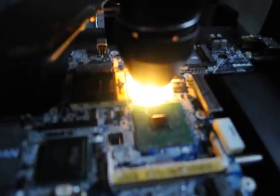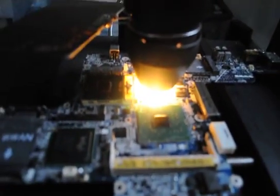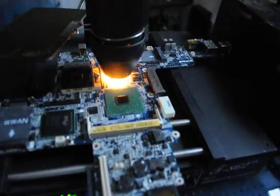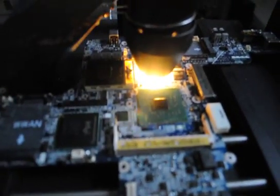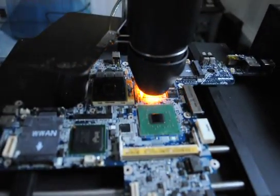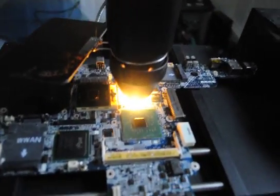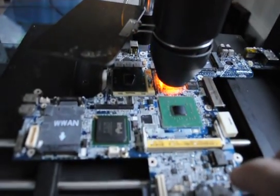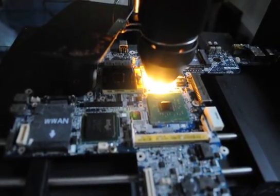What we're going to do here is just heat this one up and go through every chipset. Same heat profile, same distances, same configuration — time is pretty much the same. There's no need to let it sit for 20 minutes, then do it for 5 minutes, then up the temperature and do all that. That's only for variables outside the IR system, and that would be for, say, a heat gun.